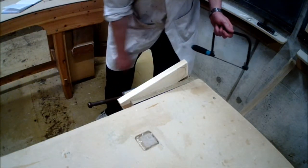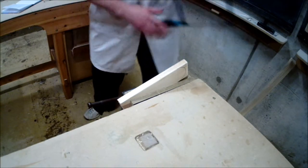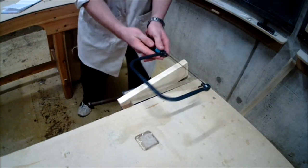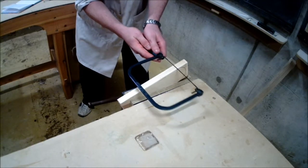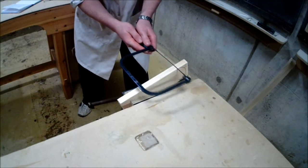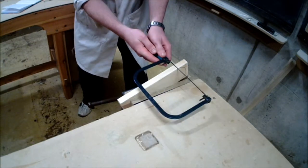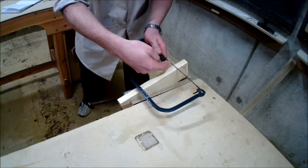As you can see, I've placed the piece in the vise at an angle so you can begin to create the cut as accurately as possible. When using the coping saw, ensure that you're using the boxing stance and also using two hands on the handle to provide good accuracy and precision throughout your cutting.